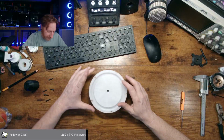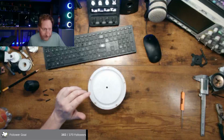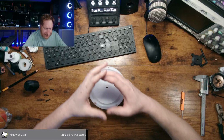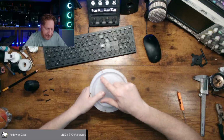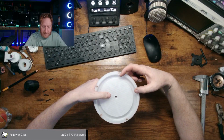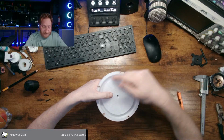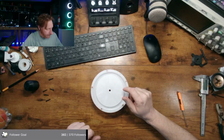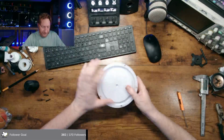This is going to sit in there just like that. But I don't have the bottom plate fully designed yet. The bottom plate is going to have the motor, and this is all going to be covered. We're going to have five pipes coming out here, so it's going to come up like a cone shape and come down like an oblong cone. It's going to come down into five separate tubes, which will then go down into the burner. So yeah, that's all we can assemble on that, because I don't have that bottom plate done yet.